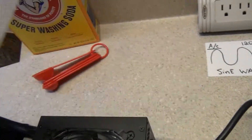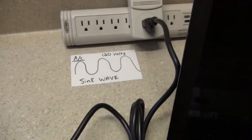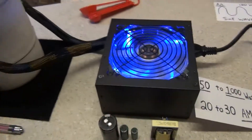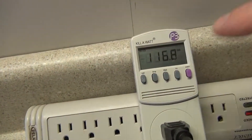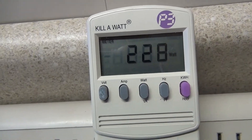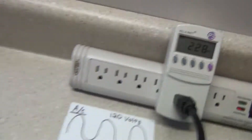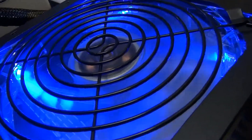You want to have a really good, powerful power supply if you're gonna do HHO, because once you turn on the power and click this on, everything starts to come to life — you can see the gas being produced. This kilowatt meter tells you how many amps you're pulling; I'm only pulling 1.98 amps — almost 2 amps — at 228 watts. This power supply has shark technology; it's completely silent, you can't even hear it running.